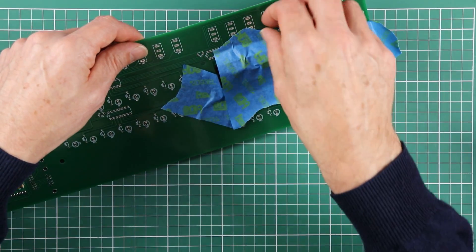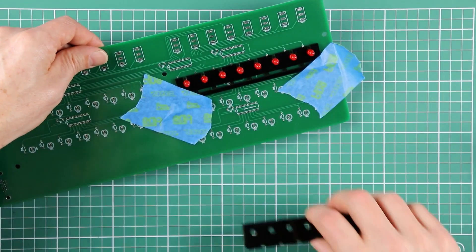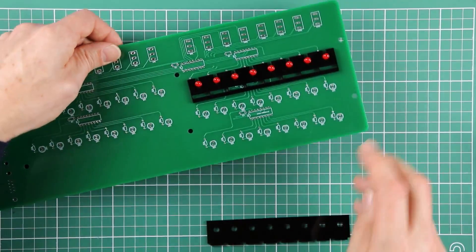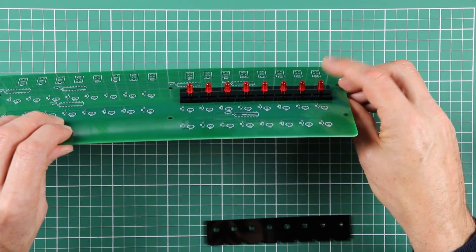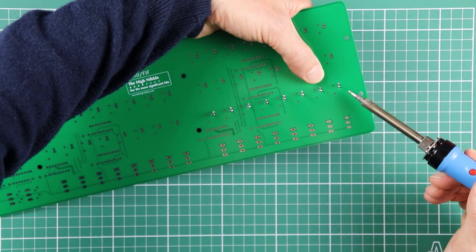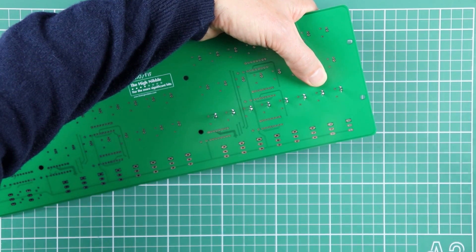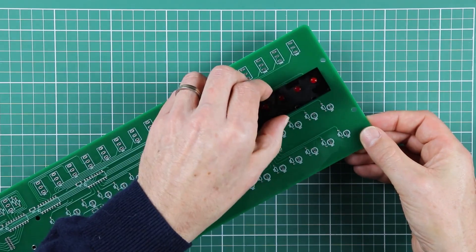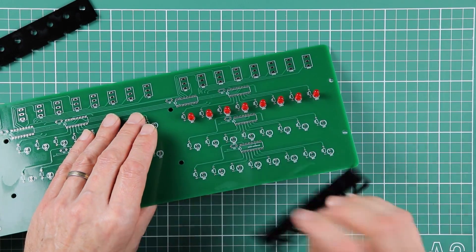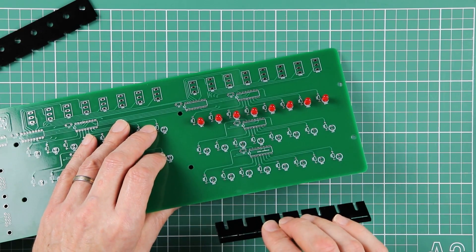Before cutting the excess leads off, remove the tape and alignment guides and check that everything looks even. If any LED is sitting up slightly, put the alignment guide back on and use your fingers with a little bit of heat to push that LED home until it's sitting flush. Then just slide out the alignment guide — it will be ready for the next row. You can see the sense in working up the board: each time you just slide that black piece of acrylic out towards the top.